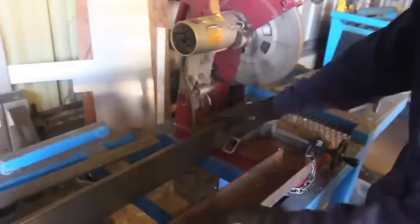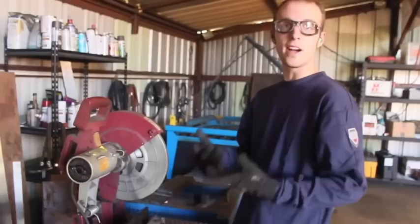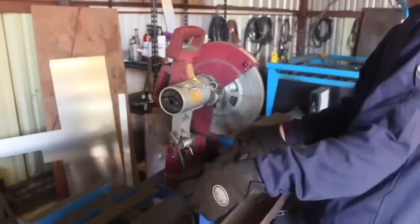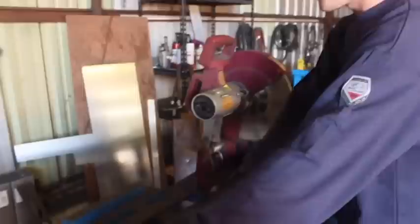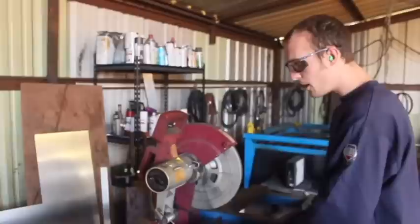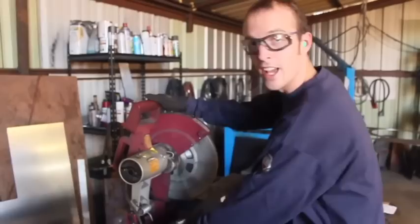Here's a little tip. I've got a pretty good chunk of this material cut out, and all I have left is to cut out these two pieces from this short bar of steel. A slight time-saving tip: what I need out of this is a pair of 11-inch pieces. So instead of marking out to 11 inches, cutting it, waiting for everything to settle, getting my tools, and marking out the next piece, I'm just going to cut here, then here, then here, and my scrap is in the middle. It saves switching functions over a long welding career and really adds up.